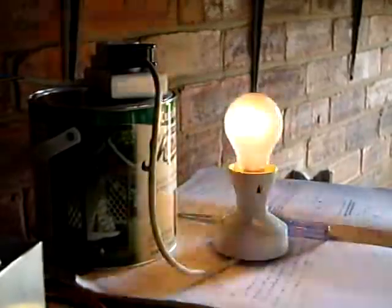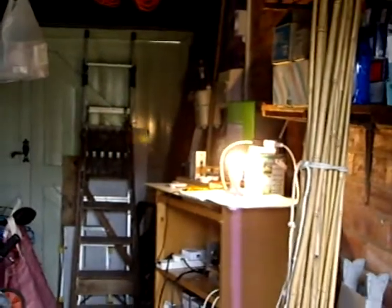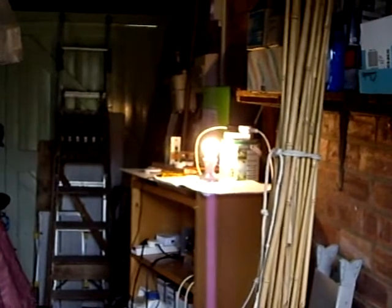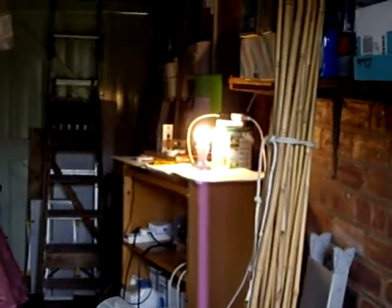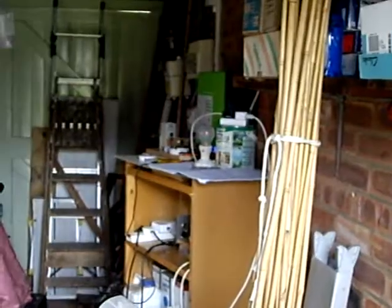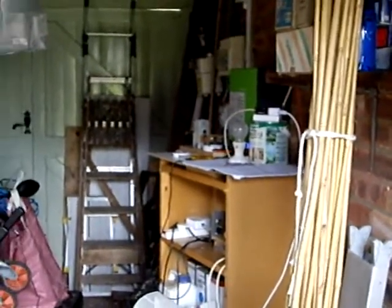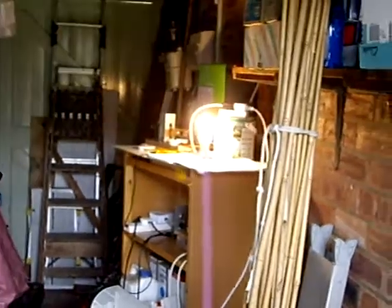Now we've got to 1800 watts and we've just got a little bit of power to distribute. Remember we've got the Bosch on 750 watts. If I take that 750 watts off, you'll find we've now got a much more responsive system. Now all the spare power is trying to be put to the immersion - the immersion is not on, the only load is 100 watts. Put on the 750, and because we've got more PV power coming in - more than sufficient for both the bulb and the hot air blower - we're not getting flashing. As soon as I put on double power, that's so much that there isn't any spare. Put it back to halfway and we should start seeing the light come back on, but it does take some time to build up. There it goes. And switch off again.